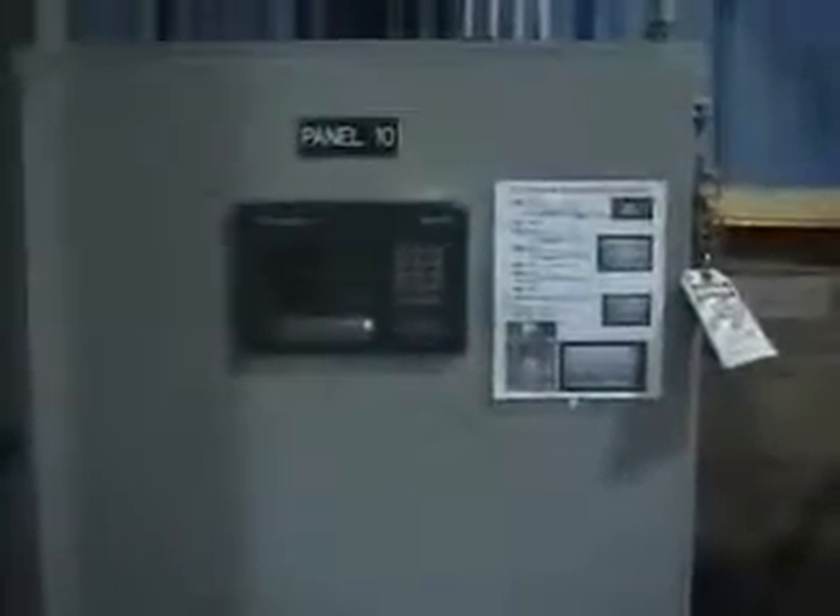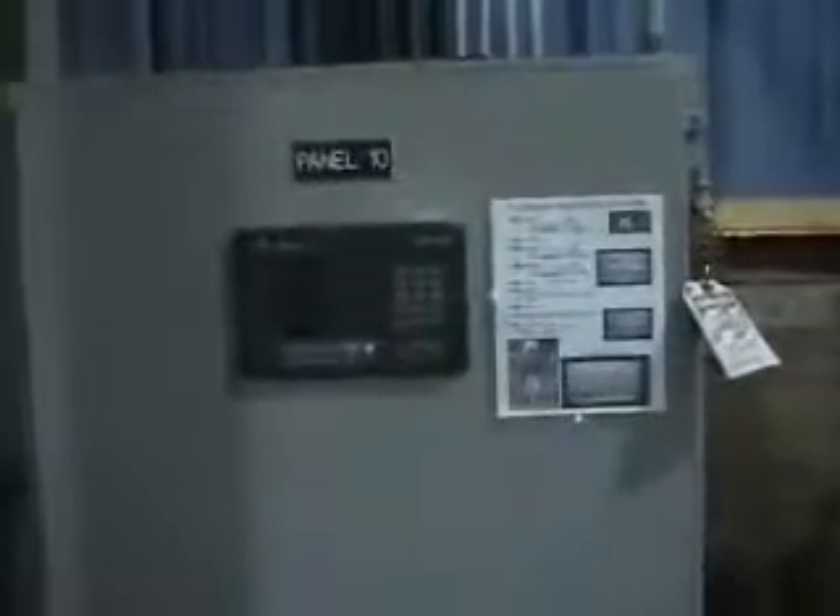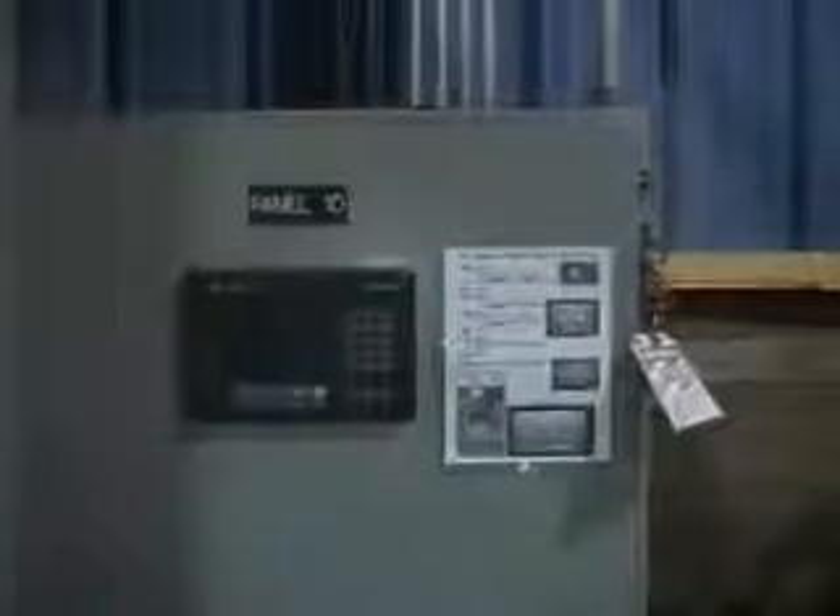Based upon the selection here, the control system is here. They choose which feeder they want to go to at which plant before they transport. Everything has to match — the number of the feeder that's programmed to receive that material has to match where they're trying to send it. Then it will be pneumatically transferred to one of two plants to the correct feeder.